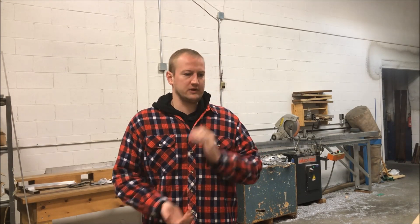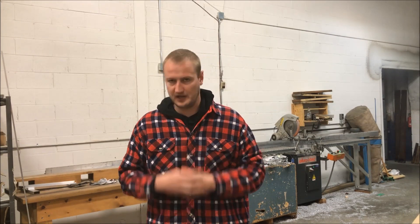Today we're going to be talking about changing some of your operational plans in order to save tool life, in order to save time, in order to do large amounts of material removal fairly quickly. All we're going to do today is show you a part that involves a lot of material removal, and this is one way to do it. We're going to mill out large sections of the profile before we flip it over to actually do the profile, turning what could be essentially one operation into three. We're going to save some time, save tool life, and use normal length tools.